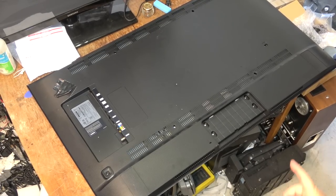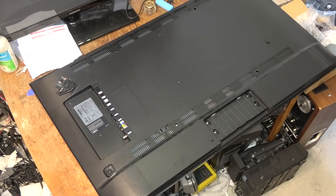This is a Samsung 49 MU6300 — completely dead, no standby. The owner is adamant that it gets fixed because they've got a Control 4 system for remote control in their home theater setup and their distribution is all done component video. New TVs don't have component video — they've done away with all the analog inputs and everything must be done HDMI. The cost of upgrading a Control 4 system to support HDMI is quite expensive, so they want to fix this one.